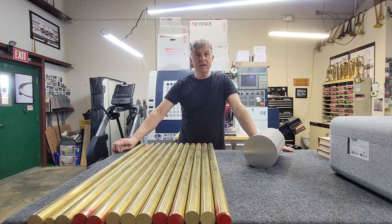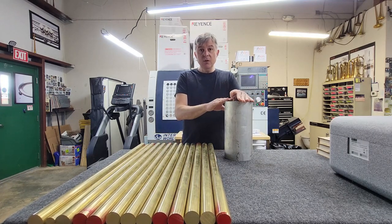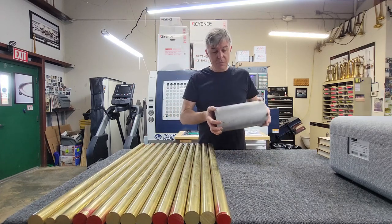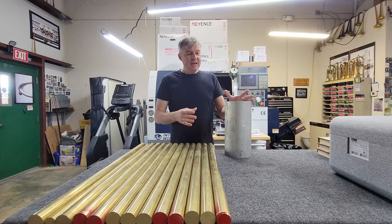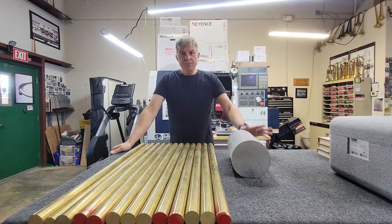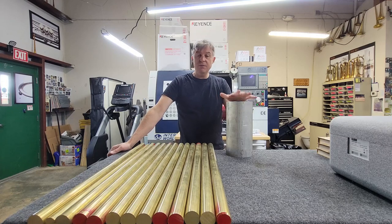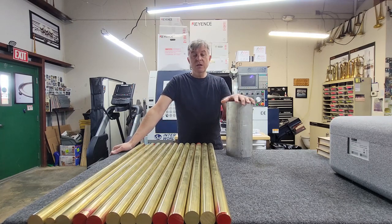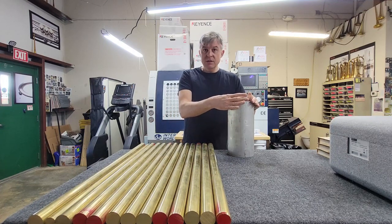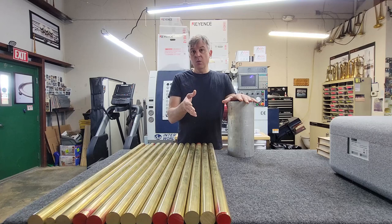This bar of aluminum is something you would see on the live tour — it's six inches in diameter and I think this one is 12 inches long. That bar of aluminum will become a trumpet bell on the Muse. We can machine this down into a full bell that's lightweight and only weighs a few ounces. But that bell would be different than a spun bell. You might wonder why you'd go to all that trouble to turn this into a bell when you could do it some other way — the reality is there are not very many ways of doing it.